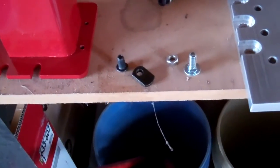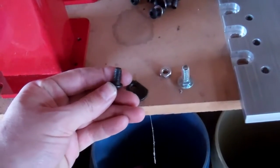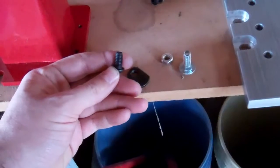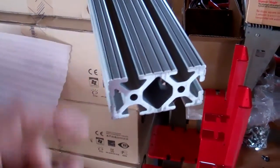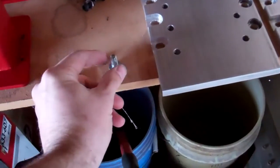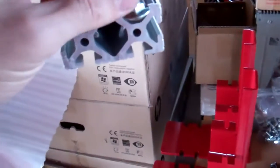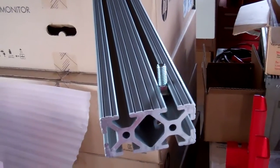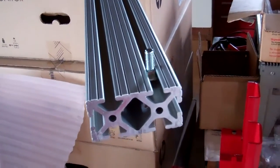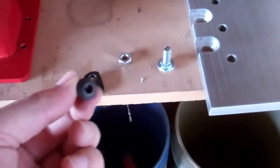The only problem with T-nuts is that you have to get the bolt length almost exactly right. These are 5/8-inch long in order to mount something a quarter-inch thick into the channel. The advantage of the carriage bolt is that you can use an unlimited bolt length — it just sticks up above and you cap it with a normal hex nut. I'm not exactly sure which is better; I much prefer the look of the black oxide finish with the nice round button head.